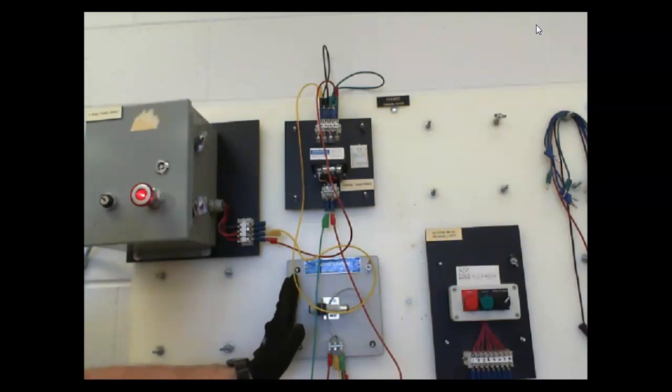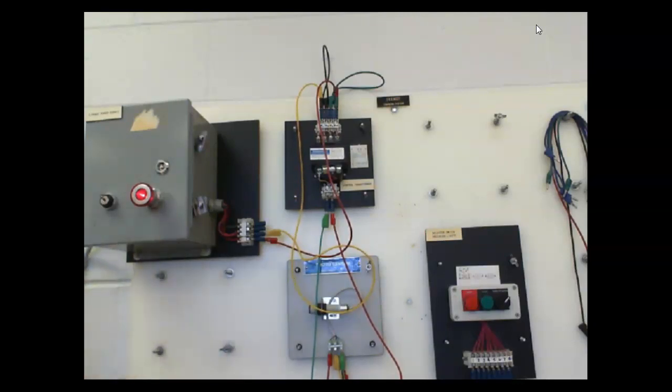Right there. So see how close I have to get it? About 2 inches before it picks up the black. Now, if it's white, which is highly reflective, it picks it up right there, which is probably about 6-7 inches. So yeah, it'll pick up black. If it didn't work, the Festo line wouldn't work, because the Festo line has black cylinders on it, and it has to pick up those. We just have to adjust them so it does.